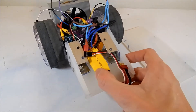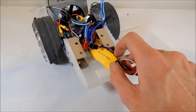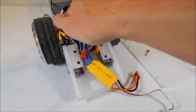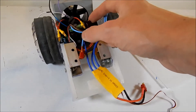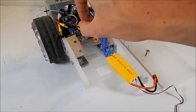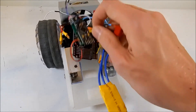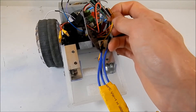I don't have enough room to fit this ESC, and I really can't put it anywhere else because otherwise it's going to interrupt the airflow to the EDF out the back. On top of that, plugging this stuff into 12 volts, I actually managed to fry the regulator on this Arduino. This is a cheap Chinese clone of an Arduino — Arduino voltage regulators are supposed to go up to 12 volts, but this one died.